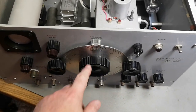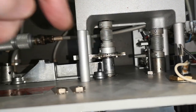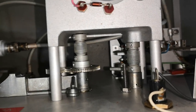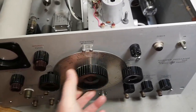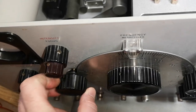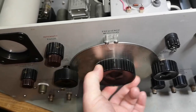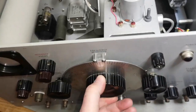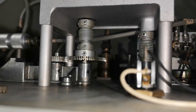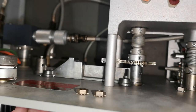It was very easy to clean up all the old mechanics here. The old grease had definitely turned into chewing gum. This piece of plastic here is actually a little bit worn down, so it could be a good idea to change it because there's a funny feeling coming from it. But now I can move everything after a little bit of cleaning - nice and shiny. They actually got tiny little holes here for cleanup and lubrication on all parts that can move, which is really super smart.